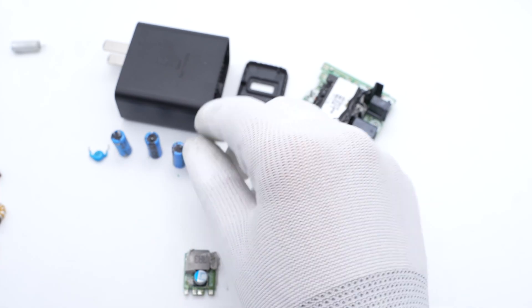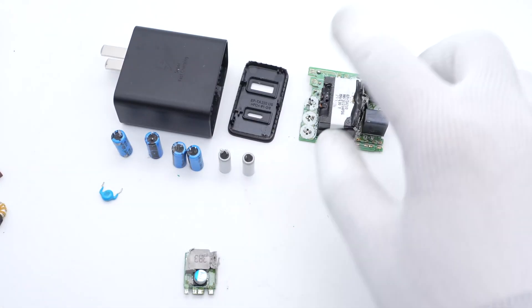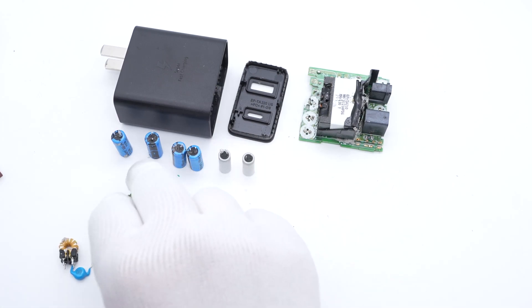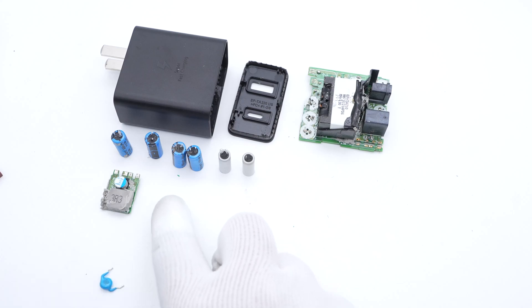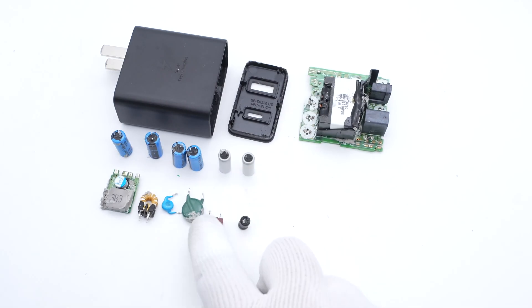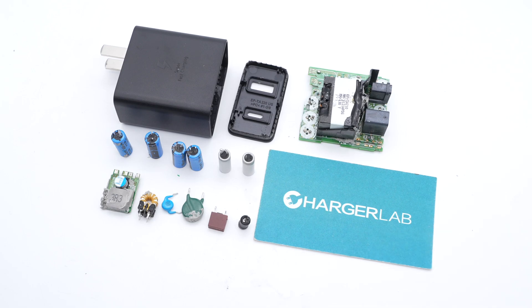That's all the components of this Samsung 35W dual-port charger. It's like the Samsung 65W trio charger we covered before, but with one less USB-C port and roughly half the total power. After taking it apart, we found the two USB ports share the same switching power supply circuit but are controlled by two different protocol chips, and the USB-A port is controlled by a buck-boost circuit. If the Samsung 65W is out of your budget, you can consider this one. Okay, that's all for today's video. Please like, leave your comments, and subscribe. I'll catch you guys in the next video. Bye.